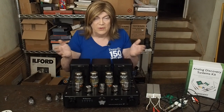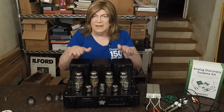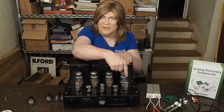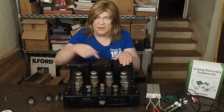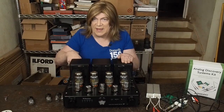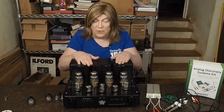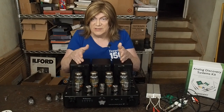This isn't a huge amount of money or a hard modification to fix. So one of the first things I'll do is solve the grounding problems. I also haven't investigated how the ground bus for the input driver and phase splitter section is handled — it looks like one end is grounded then runs bundled with signal wires back to a ground point that may not even be the same one. I also haven't investigated how the safety ground from the IEC connector is connected to the chassis, whether they're sharing a ground point with other stuff, how the potentiometer is grounded, or how the input jacks are grounded.